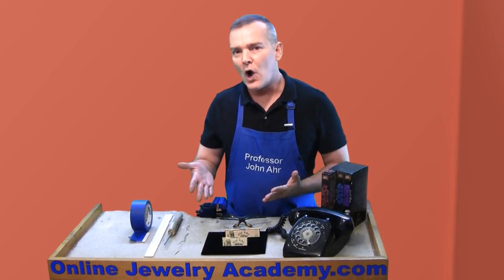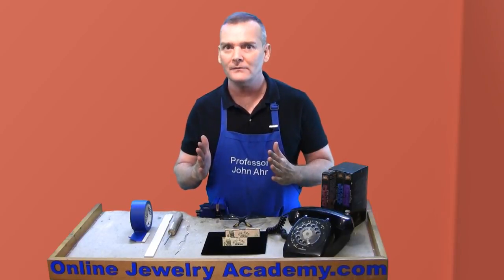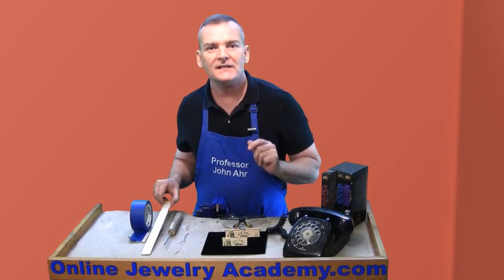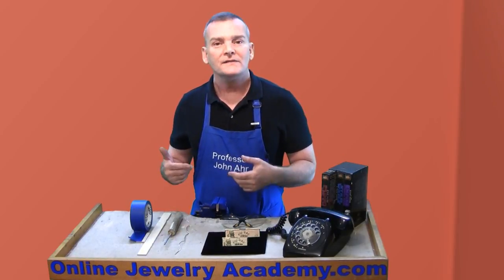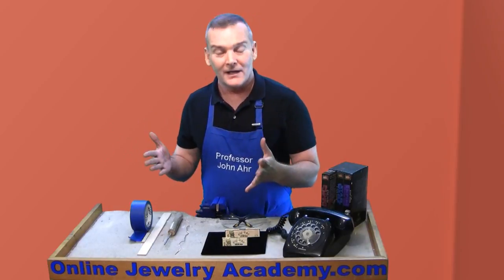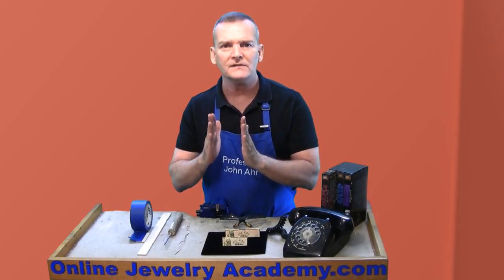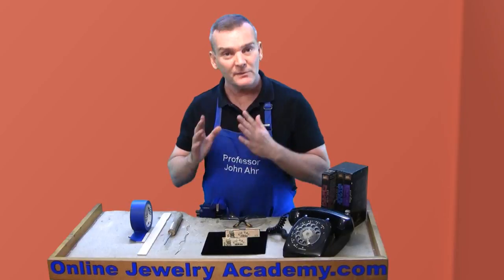This video is gonna center on the use of older technology, because sometimes the old things are great and they work so well, and there's no improving on them. What we're gonna use is a wide blue painter's tape along with a paint stir stick. This idea came to me from my colleague at the Fashion Institute of Design and Merchandising in Los Angeles. Professor Robert Ackerman was an apprentice in a goldsmith studio in Switzerland. He showed me how you can coil a wire on a mandrel so that you maintain the annealed quality of the jump rings.